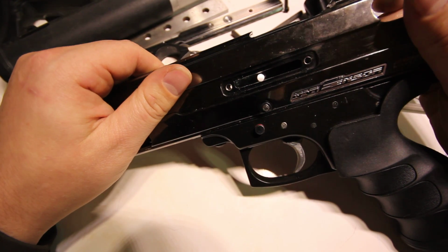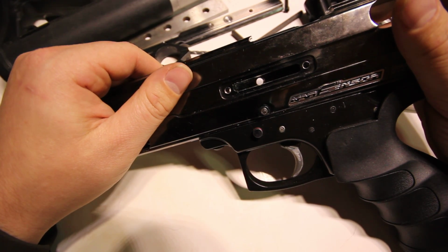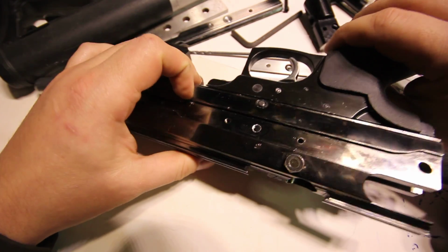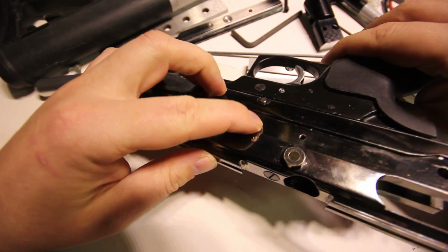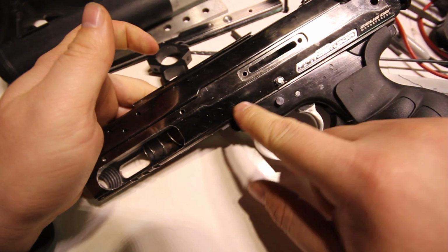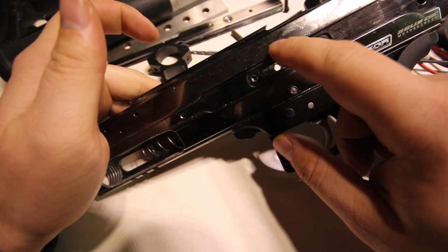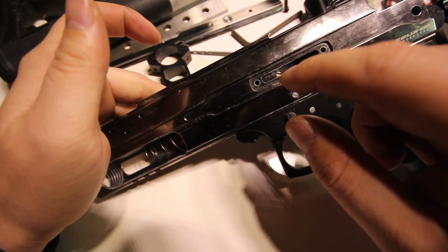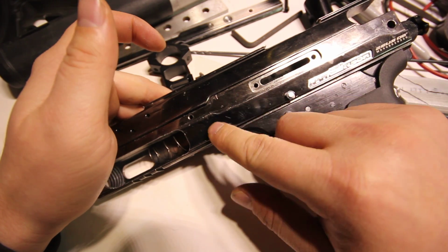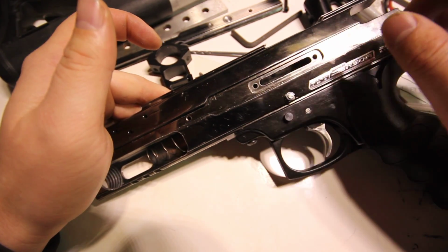And then I looked at my gun and I realized I fucked up because this chamber, where I was supplying my compressed air to, sits after the valve. The valve is here. This chamber is an expansion chamber between the barrel and the CO2 piercing assembly and the valve and the hammer mechanism.